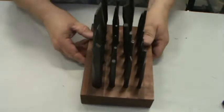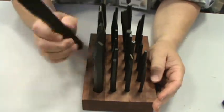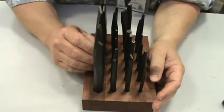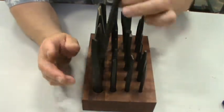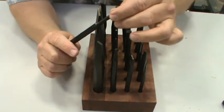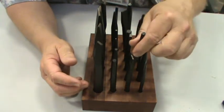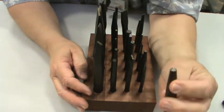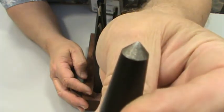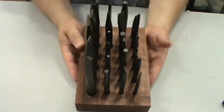Some other miscellaneous tools: chisels and punches. Chisels are used for cutting and prying things apart. We have punches for centering and aligning — you can use these to punch a hole through a piece of material. A center punch — the one with the pyramid tip — is used to set a spot to start a drill on a piece of metal.